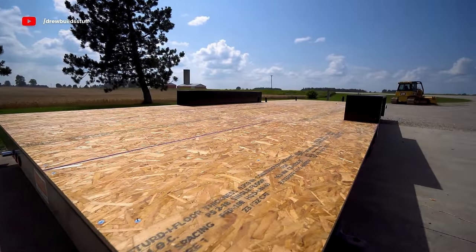Then I turn the blade on my table saw to the 33.5-degree slope of the roof. And then I'm just taking an edge off of these 4x4s. Why I didn't have the fence over an eighth of an inch so it would have cut this clean through, I don't know. I guess I just wanted to use the handsaw.